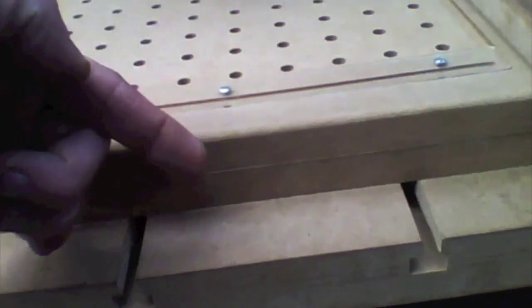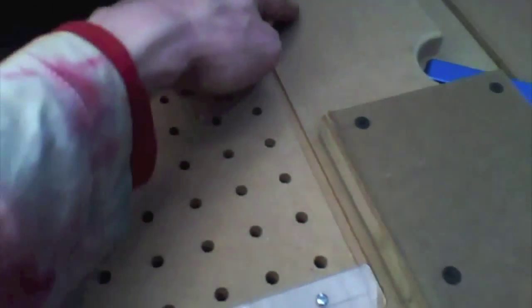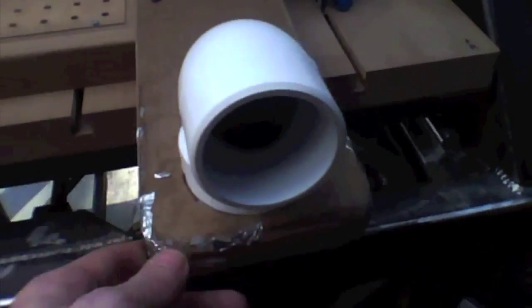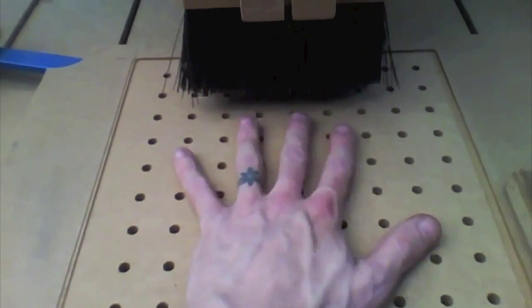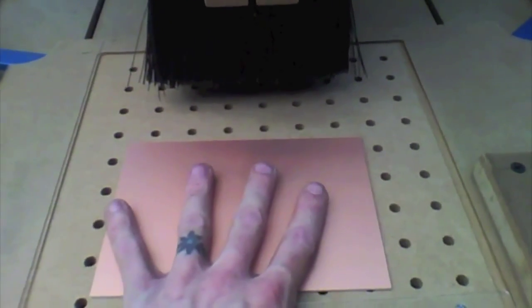It's hollow inside, actually more like a honeycomb or a grid, with a channel lining up with each one of these holes that lines up to a recess here, which goes through a hole here. This is hollow. This is actually a duct made of 3/4 with some 1/4-inch material on either side, and eventually goes to this port where my shop vac will attach. Now, so it's just a reverse air hockey table. The board gets sucked down like that to keep it flat while milling.